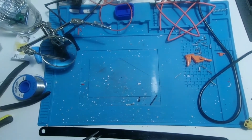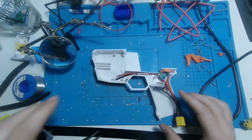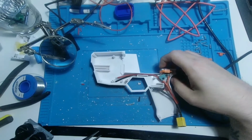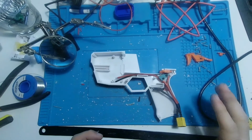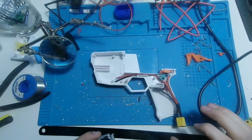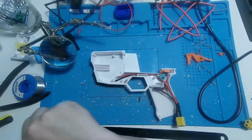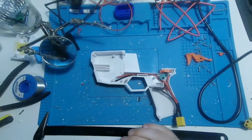Okay, so now we're going to talk about wiring. It's been taking me a little bit of time, but this is now all wired together. This is because this switch is really not designed for the kind of amperages that we're going to be putting through it. I have used a MOSFET in order to keep the current out of the switch. Now, this is a 3034 MOSFET because it needs to be high enough to take the current of the circuit. We've got 4 Krakens in this. Well, as we've discussed, we've got a fairly hefty stall current to deal with.